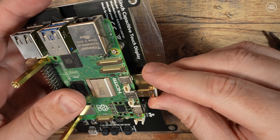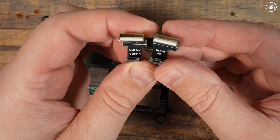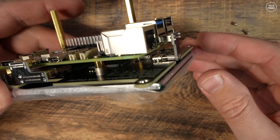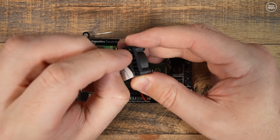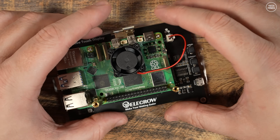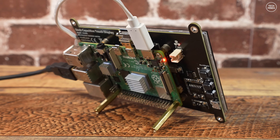The included HDMI adapter fits snugly and works perfectly for video output from the Pi to the screen. There's also another adapter which provides screen power and touch feedback to and from the Pi via a USB port. You'll have one for Pi 4 and Pi 5 as there's a slight difference in USB port positions. Lastly, attach the included fan using the double-sided sticky thermal transfer pad and plug the connector into the dedicated fan socket on the back of the screen.